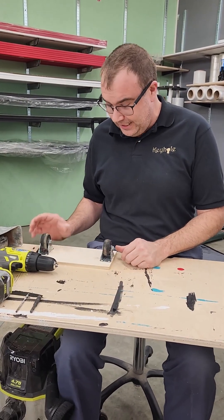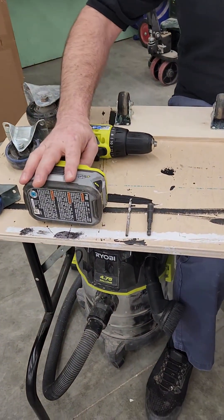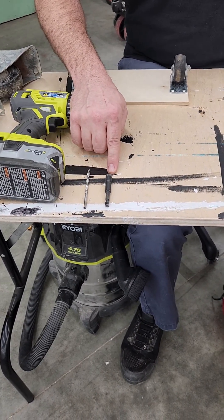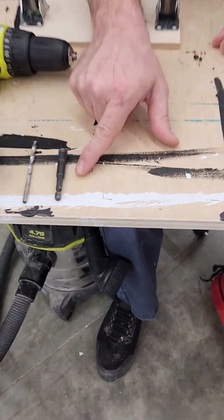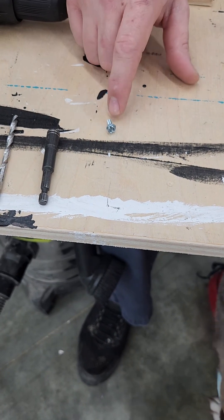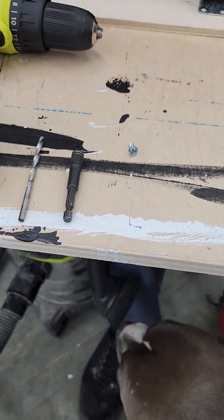To do that, you're going to need a piece of plywood, a power drill, a 3/16-inch drill bit, and the fastener driver of your choice. Today I'm going to use hex head fasteners, so I like a quarter-inch hex head drill bit — it's magnetic. These are nice and easy to put on and don't cam out easily when you're drilling them in.